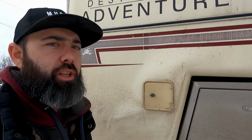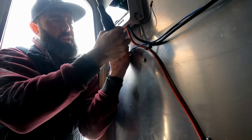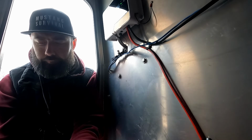This battery I have, it's good. I can use it up to -45 degrees Celsius, but it cannot take a charge below 0. These panels are pulling in 4.5 amps right now, so it's unfortunate to have to unplug them. That's some good power that I could be utilizing.